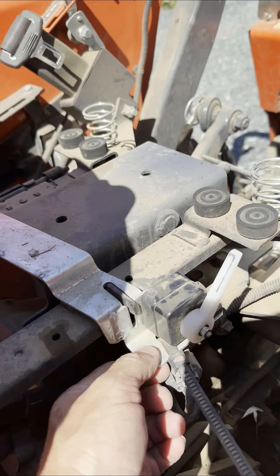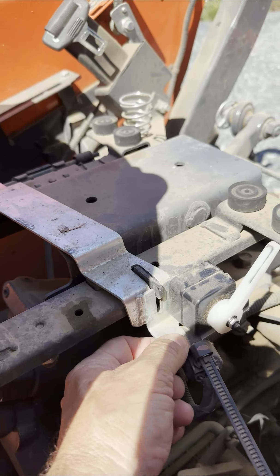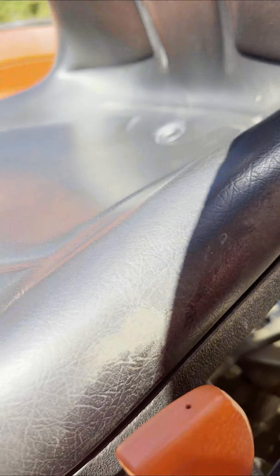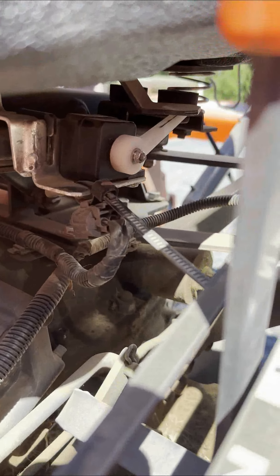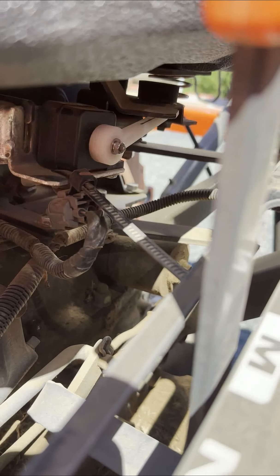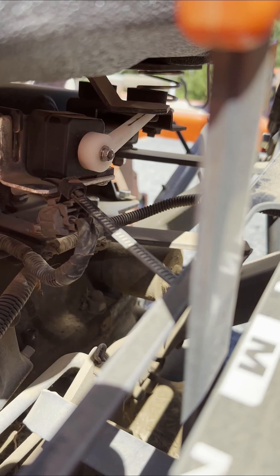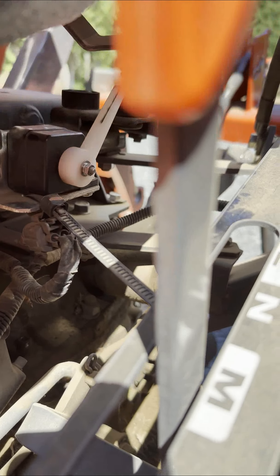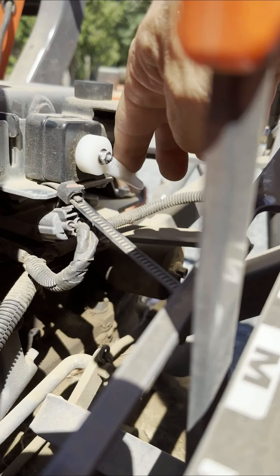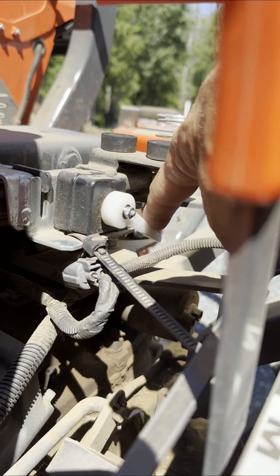What I found is that there is a considerable amount of play in this seat safety switch. The upward movement isn't an issue — it's how much movement there is downward. When the seat is down, there really isn't a lot of difference between sitting on the seat and not sitting on it. I tested this when I was having the worst symptoms by clamping this lever down, which means engaging the seat safety switch — and by gosh, the tractor ran perfectly.